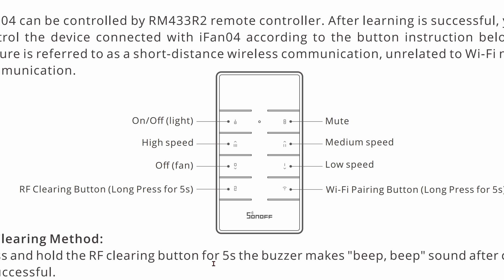As soon as you turn the circuit breaker back on, the module is going to make a bunch of beeps — two beeps, and then one long beep. It'll repeat the same pattern over and over again. Take your remote and press any button on it to synchronize the remote with the module, and the beeping should be gone.